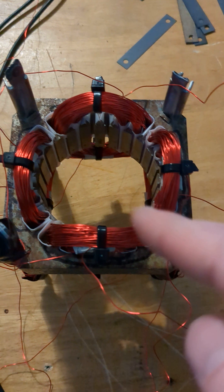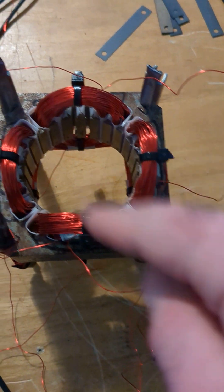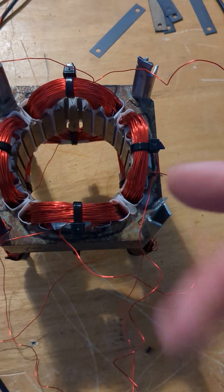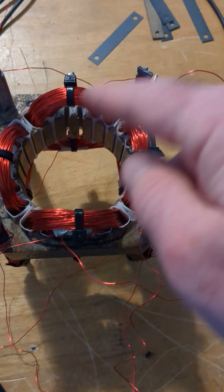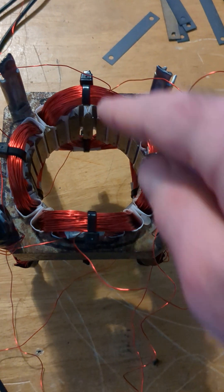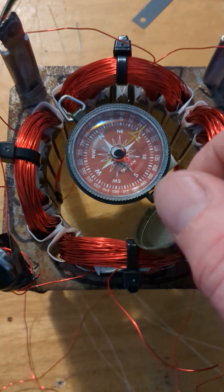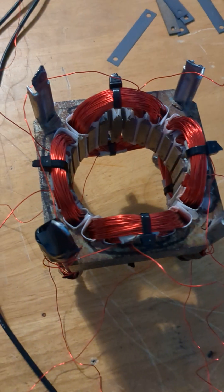That's how you tell if you have true rotation versus reciprocation or partial rotation. If it spins one way one time but every now and then spins the other way, that's not balanced rotation — because balanced rotation will only spin the compass one way. You double verify it by switching one of the leads and seeing if it starts going the other way.